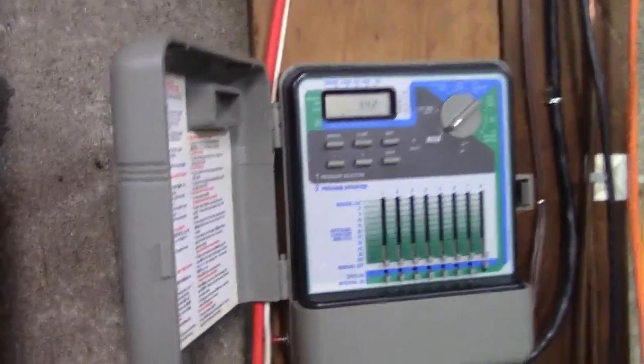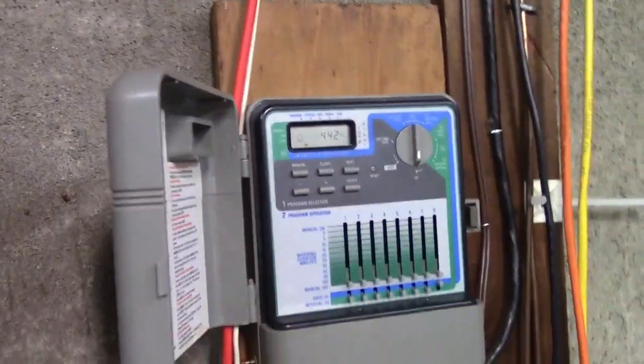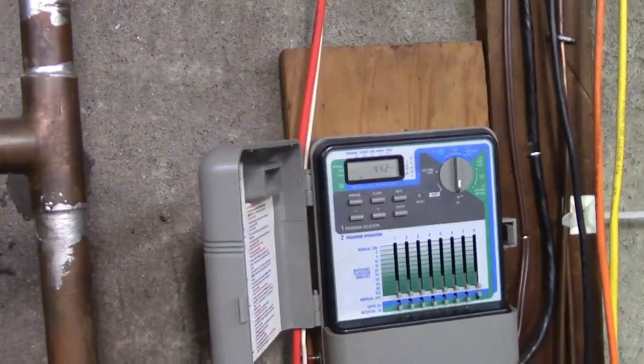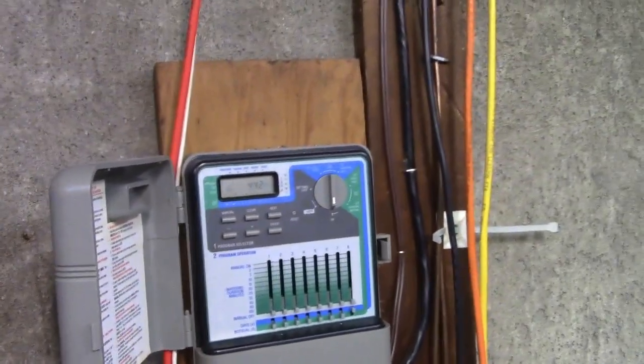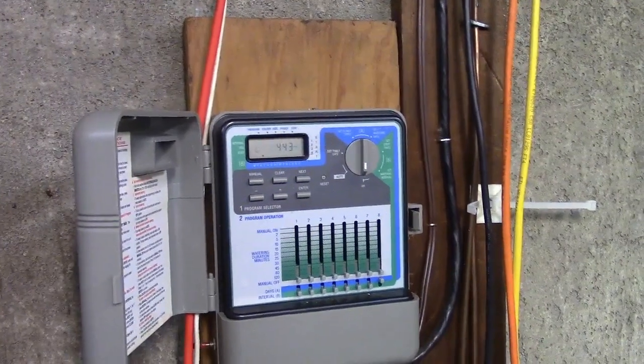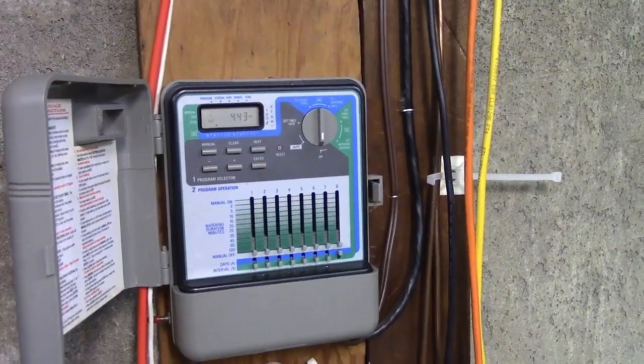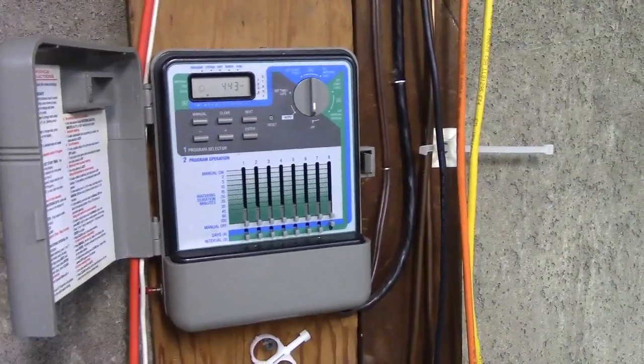The last thing we're going to do is move our control dial over to off — and now the system is off and will stay that way for the winter. Do not unplug your timer. It has a battery in there and if you unplug it, the battery is likely going to be dead by spring and you'll lose all of the programming of the times. So leave it plugged in but just set to off. That's all there is to blowing out your sprinkler system for the winter. Hopefully this video helped you out — if it did, please consider clicking the like and subscribe buttons.